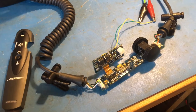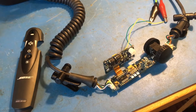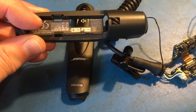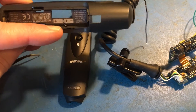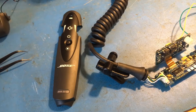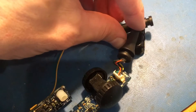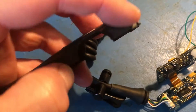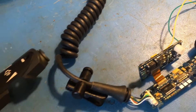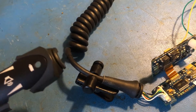The first thing you have to do is take apart the battery box, and you need to be careful - it's not a very robust assembly. There are a couple of screws located inside the battery compartment: one is just tucked under the label by the CE marking, and the other is up between the battery symbols. You'll need a small Pozidriv or Phillips screwdriver to undo those. Then there's a spiral clip which hooks around the molding at the end, and you need a thin flat-bladed screwdriver to ease one of the ends out, then carefully chase it around until it unwinds and that undoes the end.